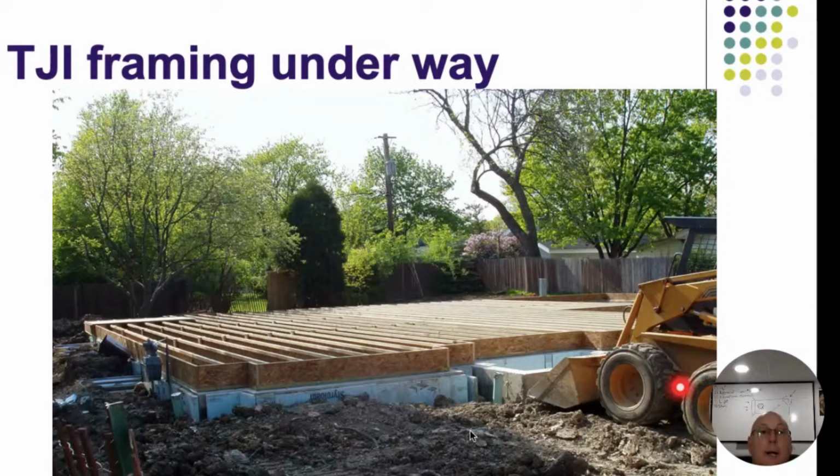All right. Here we're looking at a foundation wall. We got exterior insulation on the concrete foundation wall. I like all this stuff. You can see where the exterior of the concrete is sticking out further. That's going to be for a brick ledge. We don't have that concrete sticking out here on the sides because we're going to have siding over here. So they're probably only going to be putting brick in the front, or probably just around this area here, because this section does not look like it has a brick ledge on it either. All right, so we're going to have a brick veneer over here.